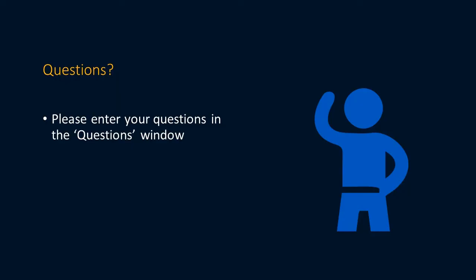And now we're going to field some questions from you folks here. So Joe, the first question we have is, can the Helios be installed outside and be okay with rain? It can definitely be installed outside and be okay with rain. Again, you may be more familiar with the NEMA 4X ratings. It's not an exact science, but as IP65 products, these have proof against water jetting, which is essentially like a powerful water hose. And so they can resist that kind of pressure. It could certainly resist rain or standing water.